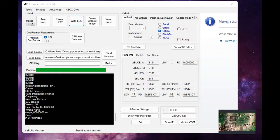Alright, we've gone and trimmed down the points on our leads right now because we don't want extra wire hanging off on these points we're going to solder, because it could reasonably short out if something brushes up against it. We'll try and eliminate any of those problem spots. So we've got 4 short wires and 2 long wires that came with the ACE V3. Starting with the power and ground, we're going to go and solder these guys on.